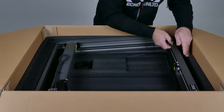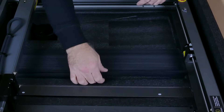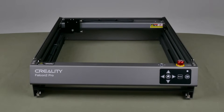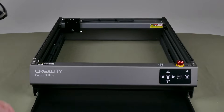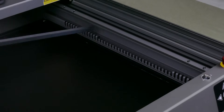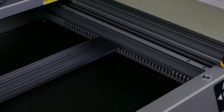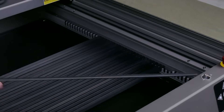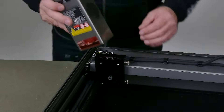You get some sample pieces of balsa wood and a calibration chart for the camera. The unit is made out of aluminum — very light and very sturdy. One of the main differences between this and the 22-watt version is that instead of a honeycomb grid it uses metal slats, and at the bottom it has a tray — whereas the 22-watt version is just a frame. This is a great idea because it catches all the small pieces that fall through. Installing the grid is really easy; they just slot in. My only gripe is I wish they gave you more of the metal strips.